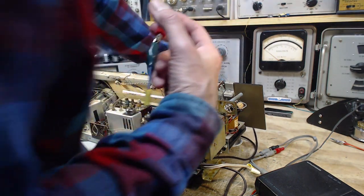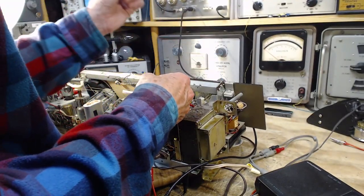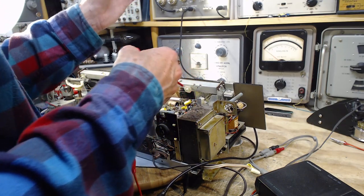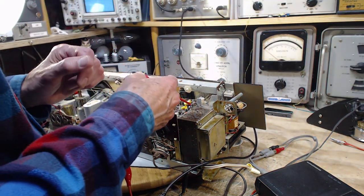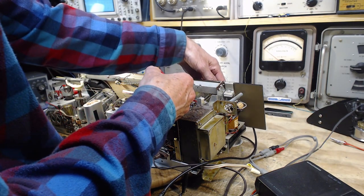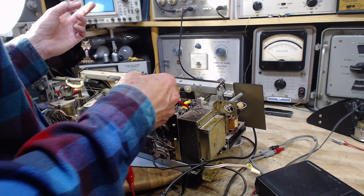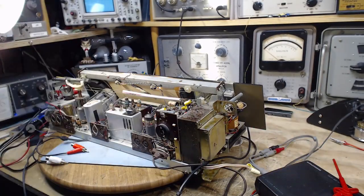Wow, okay, more observations here. This is AM radio. Yep. Same now in both. And then finally, the only stereo function in here, gone on one channel, quite faint on the other. Really, really gone. Okay, it's an interesting observation. Where's that going to lead? Oh my gosh, I don't know. It's going to lead me back to the schematic here.